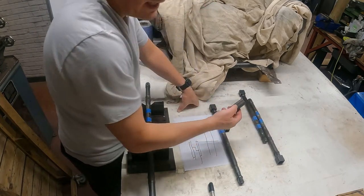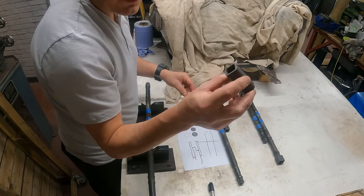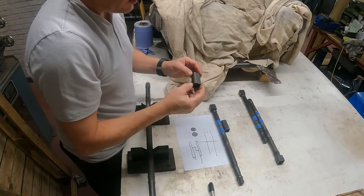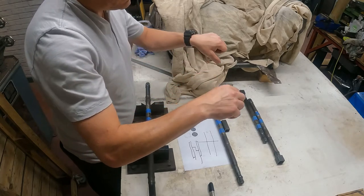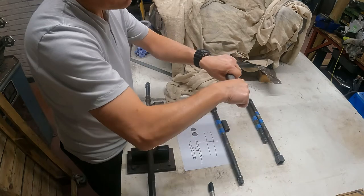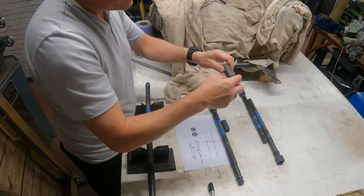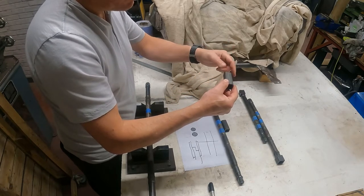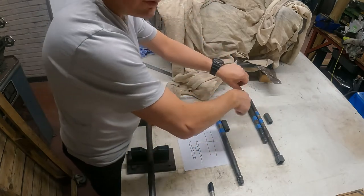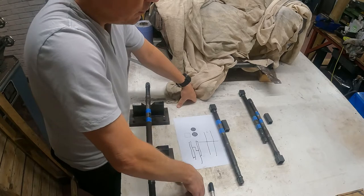And then instead of having a piece of cylindrical tube, I will have a box section joining the drive shafts, and hopefully pushing a square section drive shaft into there and a square section drive shaft into there. Maybe in the middle have some holes I can weld into, and then welding the perimeter all the way round, that squareness will stop the drive shaft joint from shearing in half. Well, that's the plan anyway.